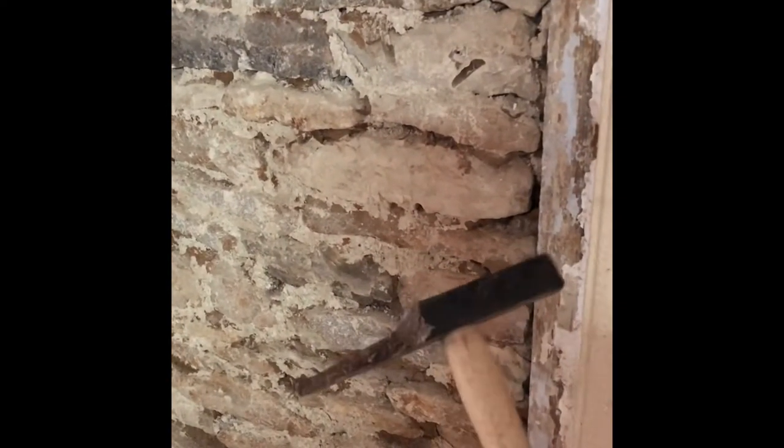You've got the brown mud which is the dirt the walls are actually built with — that's all they were built with, stone and dirt, no cement or anything else holding it together. The stones are covered in a mixture of brown mud and white lime chalk mix which isn't very nice. When I started cleaning up my stones I wasn't sure what to use. I've got a stone hammer which I ground to a fine point, and a little handmade rake tool. They do the job — it's not cement so even a small hand tool can rake out a lot of what's in the joints.